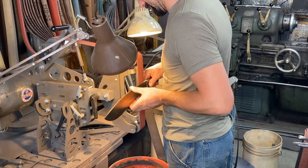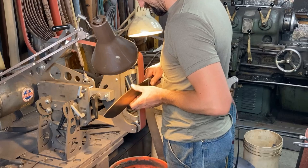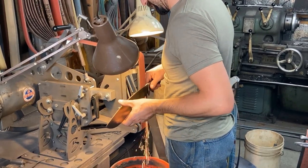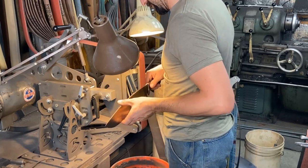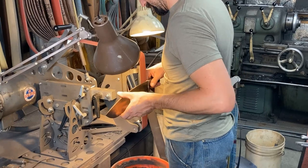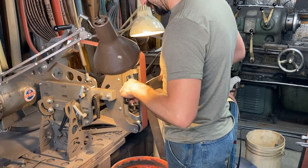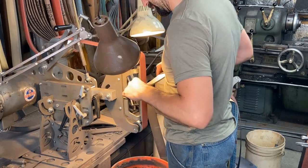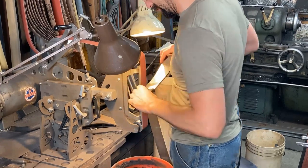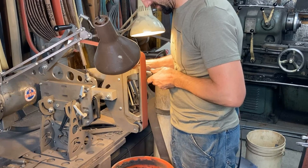And now with a nice sharp 120 belt on, we're going to do the rest of the finish grinding at 120, get our scratch pattern good, work up into our plunges how we want them, get them to a nice finished 120. And really finish dimension everything for the last time here. Change anything we might want to while we're still at this relatively coarse belt.